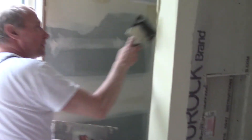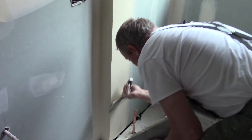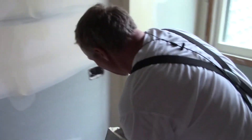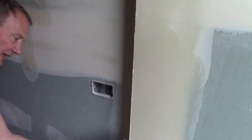This is hard to do right here — my wrist doesn't want to turn that way anymore. It did 40 years ago. At 27 it was easy; at 57 it's not. Now I can come back here, lay my knife down, and wipe it out, and it's going to leave enough mud. My mud runner actually filled this in pretty good, so I don't have to worry about this edge. I just want to make sure it's nice and tight and skimmed so it sands easy — that's what I'm doing with a lot of this detail work, just making sure it's going to sand easy.